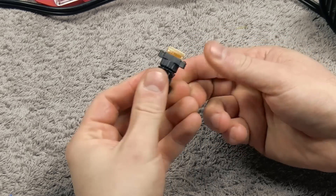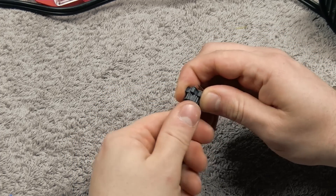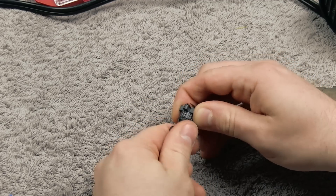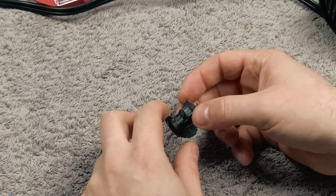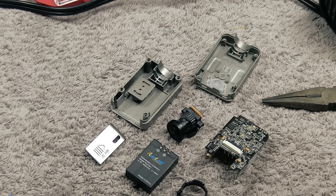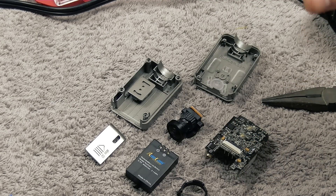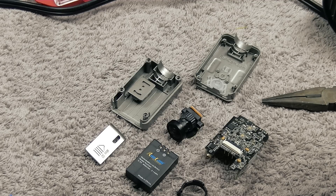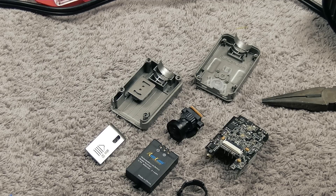The problem now is you can't lock the lens as easily as on the Mobius with just a screw. You'd have to get it in there, get it focused, figure out the alignment, and then essentially glue it in once you know where it goes. It's more difficult, but it's one of those things you do once and don't touch again. So there you go — that's the complete disassembly of the camera. Stay tuned: I've got a Foxeer Legend 1 coming which is close to the Mobius but does 1080p 60fps, so we'll do a comparison of all three. Be sure to check out the store for mounts, subscribe to catch the video where I turn this into a zoom camera, and thanks for watching!